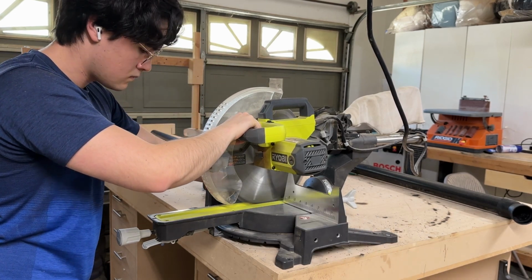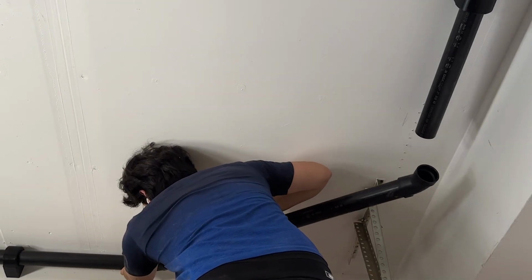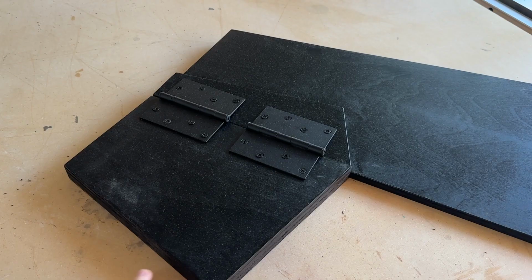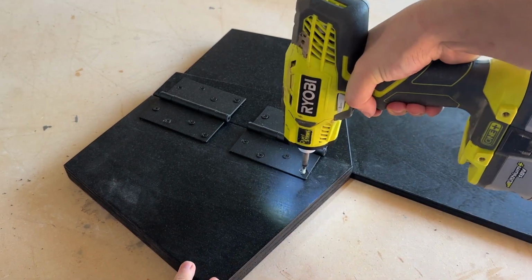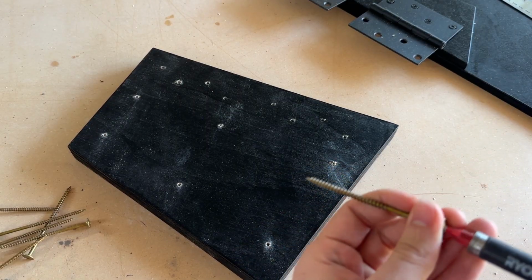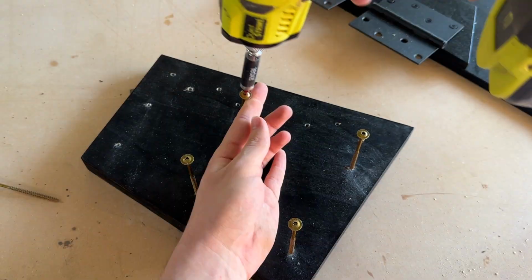I used two 45-degree bends instead of a 90 here, which does make the math harder, but it provides far less resistance to airflow, so it is worth the extra effort. Then disassembling the two sides of the arm, I can pre-drill the screws into the plate so I don't have to scramble for them in the air, just making everything far smoother.